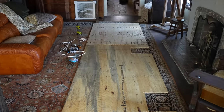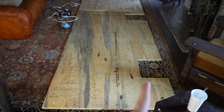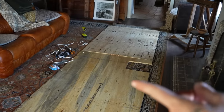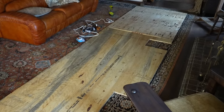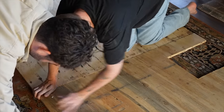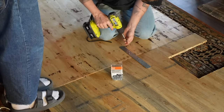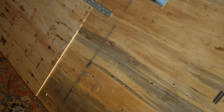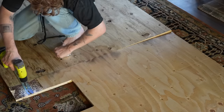Here's the wood for the headboard — we laid out both pieces: the big four-by-eight sheet with cutouts for the vent and outlet, and the extension piece to fill the whole wall. Now we're going to attach these two pieces together with a few brackets and braces. I used three large steel support brackets — just a couple dollars each — one on the front middle and two on the back side, spaced top and bottom.